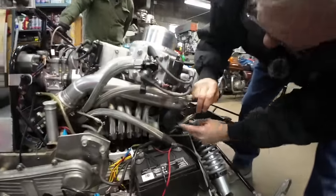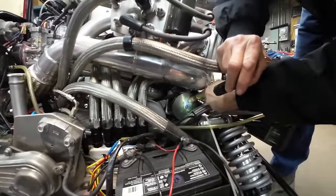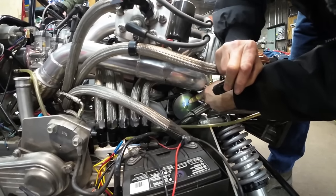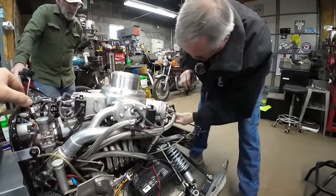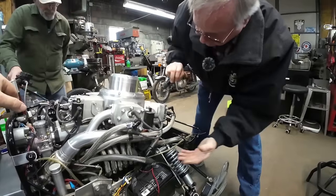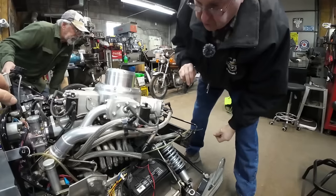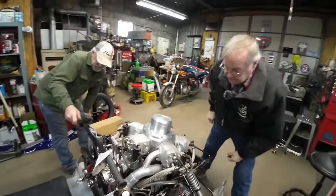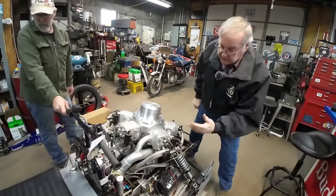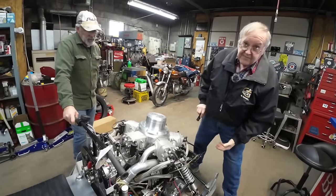But then behind that is another pulley and a drive for the water pump. Okay. So we have all that. And as you can see, there's plenty of water. This is a liquid cooled engine. I have all the water lines, two lines, one in, one out for each cylinder. And it goes through a radiator in the front. There's no cooling, what do you call them? Tunnel coolers on this. Running board. There's no tunnel coolers or running board coolers on this at this time. That can be plumbed in later, but this thing is getting filled up, so.